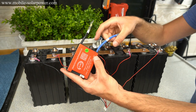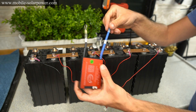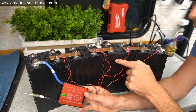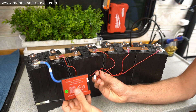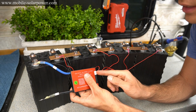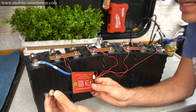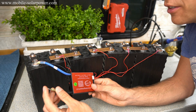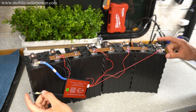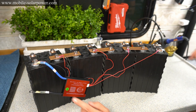Now look at your BMS and find the wire labeled B negative — typically it is blue. Add this to the main negative terminal of your battery. Now that we have the balance lead connected and the BMS wired up, we can plug the balance lead into the BMS. The moment you connect this cable, the BMS will be active and you will have power. This will be the main negative of your battery pack and you'll have the main positive. All inverters and solar charge controllers need to go through the BMS and the positive terminal of your battery.